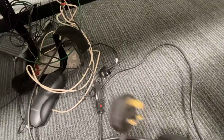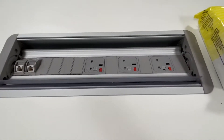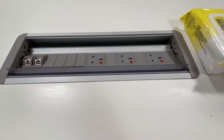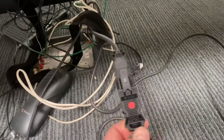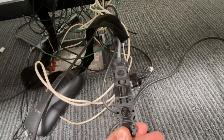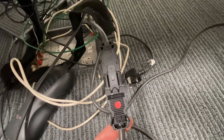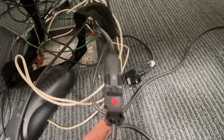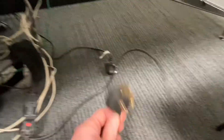Don't forget to like and subscribe as well. Today we are testing in an office where we've got some built-in desk sockets which are molded into the desk. Underneath the desk, a black cable comes down to one of these connectors here. These are quite common in offices and are called GST connectors or ST connectors. The original ones were made by a company called Wieland — W-I-E-L-A-N-D — and it's basically just a three-pole connector which connects there and then goes back to a standard 13 amp plug.